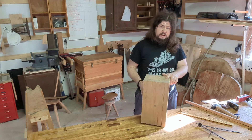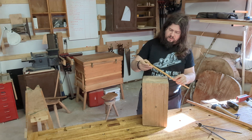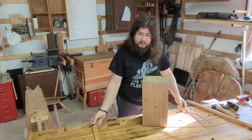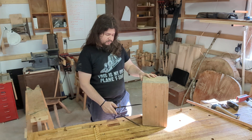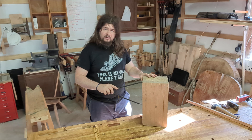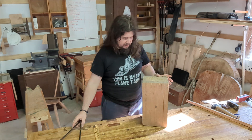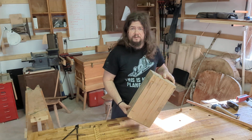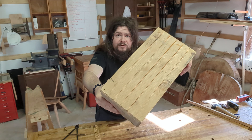This one was split into six pieces, which makes this about 16 inches long. I stepped it off with dividers. I don't have dividers big enough to do it in one step, so set this to go 12 steps and then every two steps you make a cut. You can see some of my glue lines because I didn't completely plane off the edges of the boards, and you can see that's laminated up from six pieces.